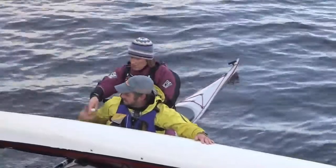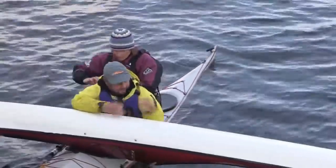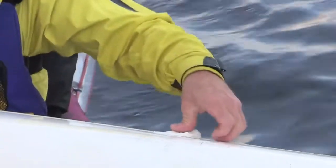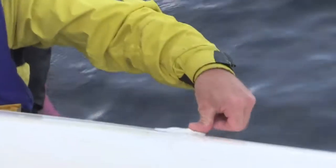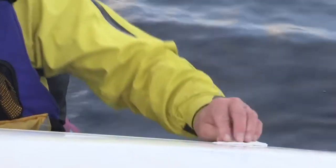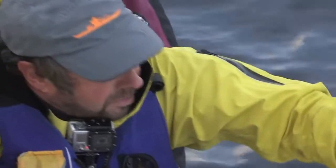How's that wax doing? Good. Great. So we've warmed our wax up, we've got a nice gooey lump, and we're now going to push that into that split. Really jam it in, smooth it out. If it's a good crack, it'll force into the crack and make quite a mechanical bond.